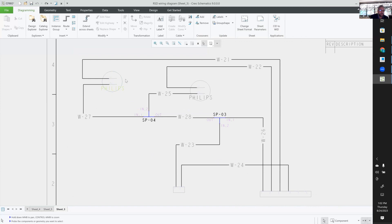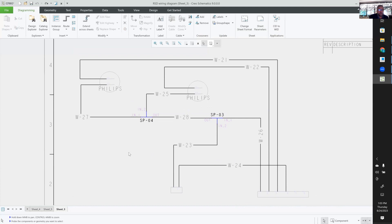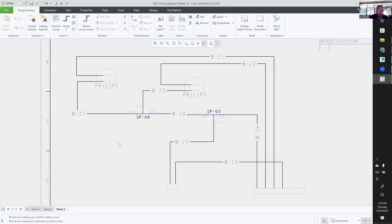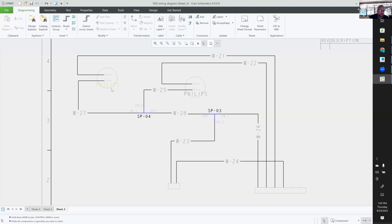In this case I'm routing to a lamp, but we all know you don't route to the lamp — you route to a connector. A lot of times when I'm teaching a class, the company doesn't want to let go of how they've been doing it; they just make connector drawings. What I really think you'd want to do is route to a motor or a lamp, knowing there's a two-pin connector on the backside. So in Creo, I'm routing to the two-pin connector, but in schematics I'm routing to a lamp.